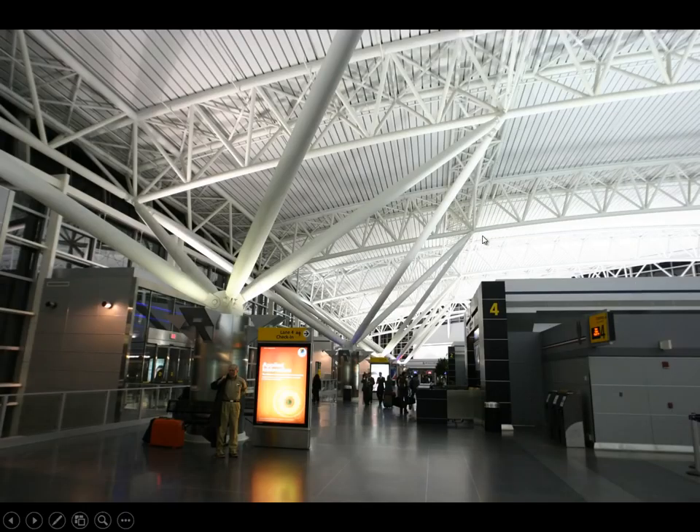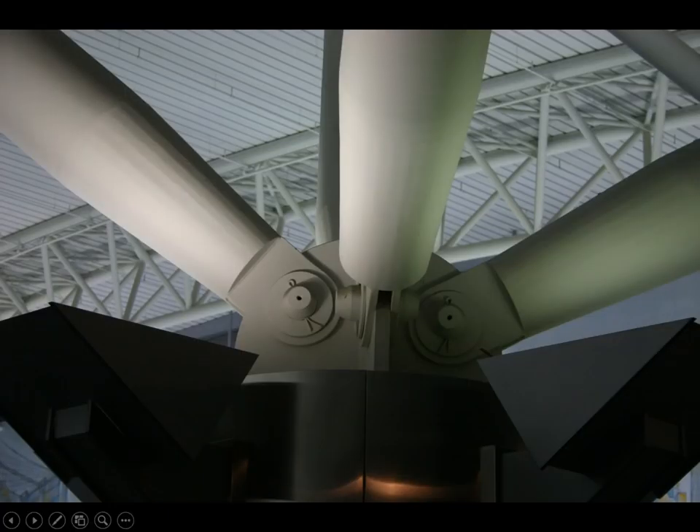This point and that point on this truss are supported as opposed to one big support, which not only wouldn't be as stable, but would increase the effective span — instead of spanning just to that point, it would be spanning all the way to there. This is the connection down at the base of those struts. They have a tapered fitting, probably cast steel, which is welded into the end of the tube and the weld has been ground down. This taper was to allow them to get nearer to the center of the connection without all the members just jamming into each other.